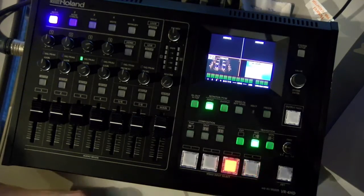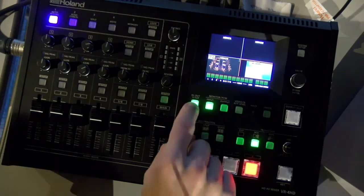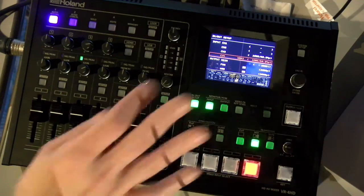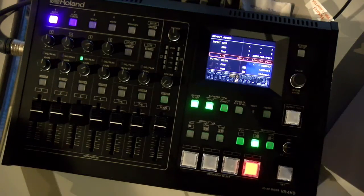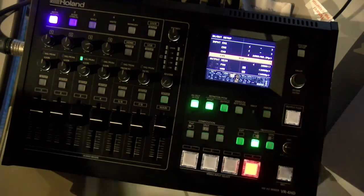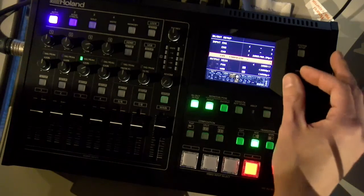Input four is our special one because it's scaling. When I go into my in/out setup, you'll see that I'm fixed for one, two, and three — channel one and two are not occupied, channel three is, and you can see its input resolution. Channel four I can switch: RGB like a VGA from a computer, or legacy products with composite, so your yellow video in.